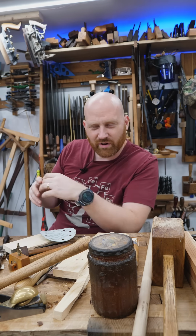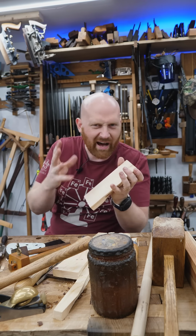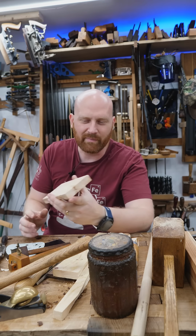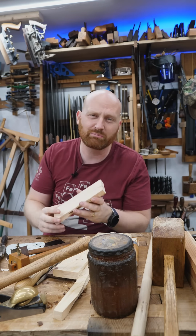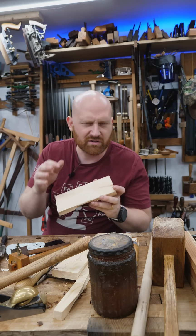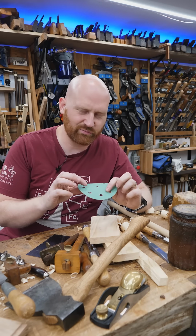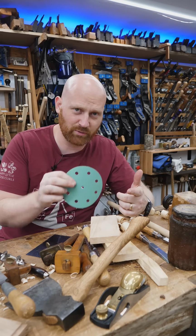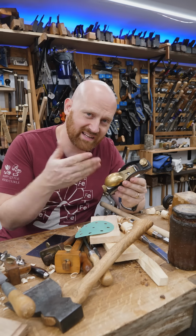You'll hear some woodworkers say that sanding will actually give it a bit of a surface to hold onto the finish, but it's kind of a myth. No matter what you do, there's plenty of surface on there. Even if you give it a really good planed surface, buttery smooth, you're still going to have plenty for the finish to hold on to. And that's why this whole thing is rather complex. Sanding is simple but difficult, whereas shearing the wood is plain and simple.